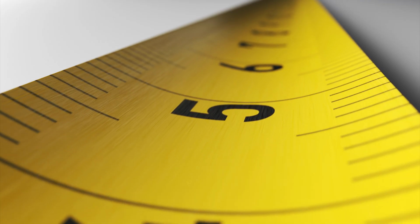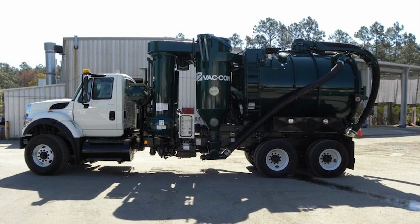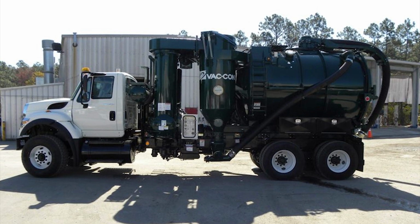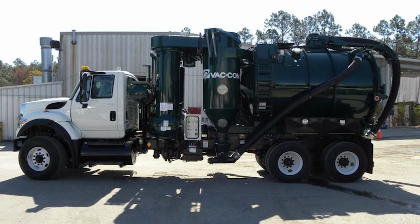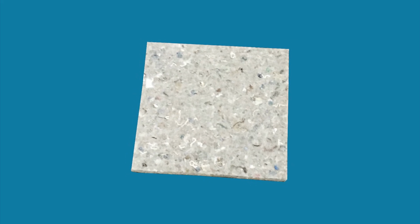Absorbent pads work best for spills that are less than a quarter-inch deep. When a contained spill is deeper than that, it's usually faster and more cost-effective to pump or vacuum a bulk of the contained spill first, then use the absorbent pads for final cleanup detail.